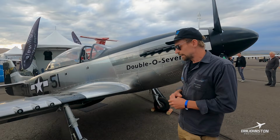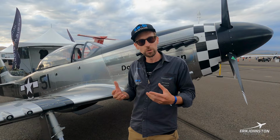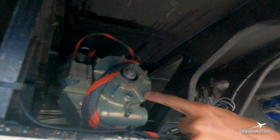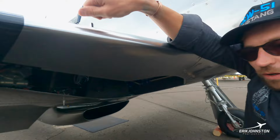And now I would like to talk about the most impressive part of the landing gear for me, and that is our electrical drive unit. This landing gear is not driven by hydraulics. It is an electrical landing gear. And how do we do that? If we have a look down here, we can see a massive block, and this one basically consists of an electrical engine which is sitting here, and that electrical engine is running a transmission gear sitting inside that casing. So the electrical engine is converting the forces into that gear, and that one is driving a shaft, and that shaft is operating the landing gear with a regular cycle time of only about 3 seconds. So it's a very quick moving one.